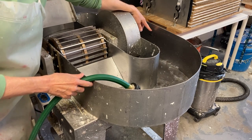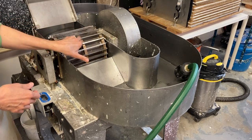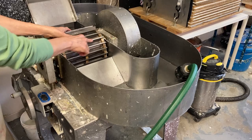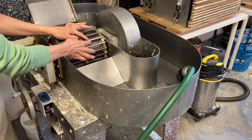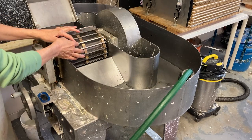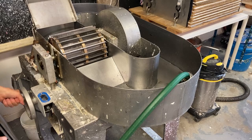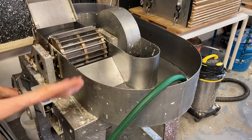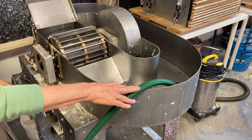This is an art, not a science. This is the beater roll which will spin around when I turn the beater on. It's got these blades — they are square blades, not knives, but the edges are sharp and they will grind against the bed plate which is underneath. I can raise and lower the bed plate to determine how hard or soft I beat the pulp.